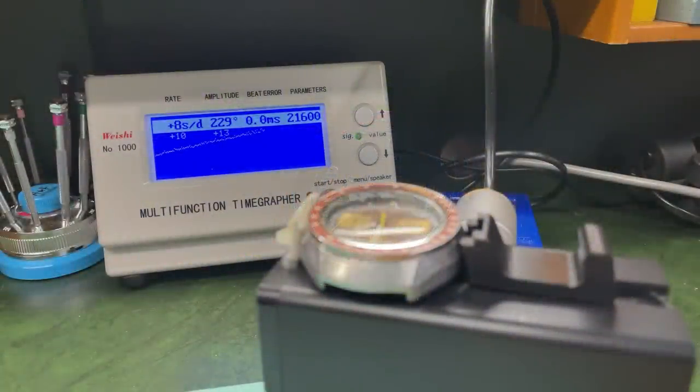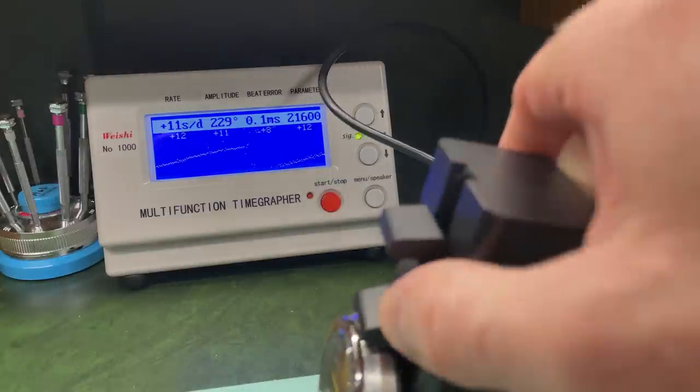Here we are on the timegrapher, and I'm pretty impressed with the results, to be honest with you. It does fluctuate a little bit. That amplitude seems to go up and go down a little bit. The rate is fairly constant, and the beat error will go from 0 to 0.1, sometimes creep up a bit more. So it's a bit odd, but considering this thing has got to be 50 years old, it was in a real rough shape, I am ecstatic, to be honest with you, that I'm getting the readings that we can see there. We can try some different positions,